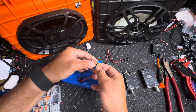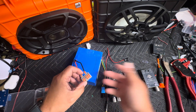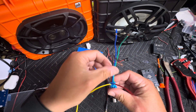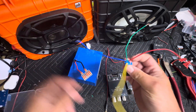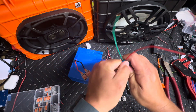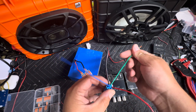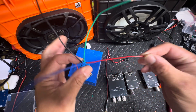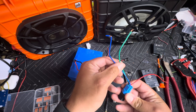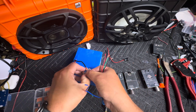The cool thing about these little lever connectors is you can actually combine them — I'll have links to all this in the description. Now on our switch, this is a five wire switch. If it has this color combo, you need to check the wires. Yellow is normally closed — we don't need the normally closed, we need the normally open wires. So I'm going to yank out that yellow. Green is your common, black is your negative, red is the LED positive. These two are only used for the LED light, and these two are for your input output voltage.